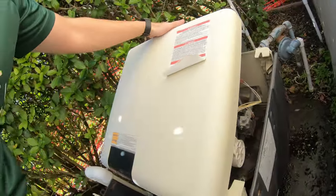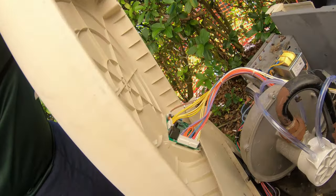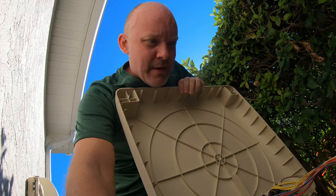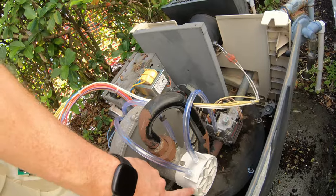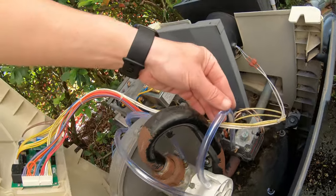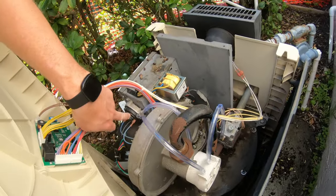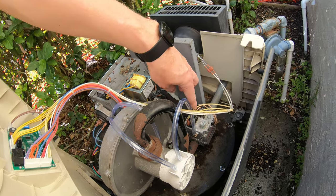There's a control board back here, so make sure you don't bend those wires. Immediately when I opened this up it smells like a zoo — there's a lot of rat droppings in here. What I notice is all these vacuum hoses at the intake of the blower are all chewed up by a rodent or squirrel. These provide vacuum to the sensors, and those sensors allow the gas to kick on and regulate it.